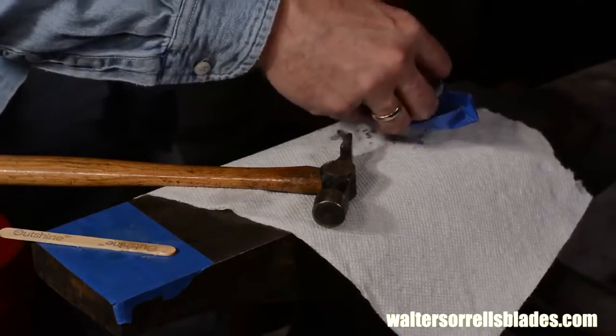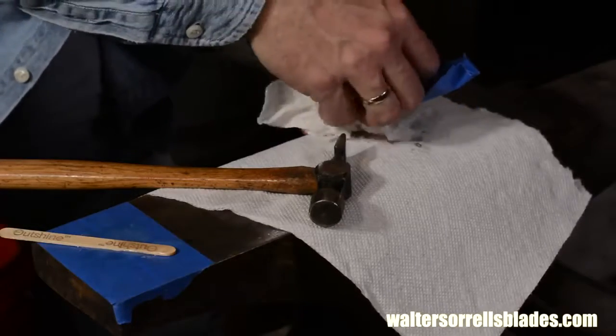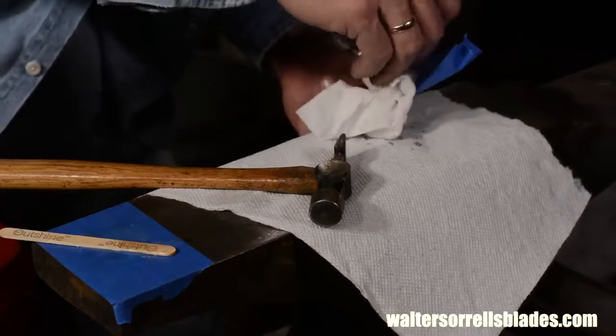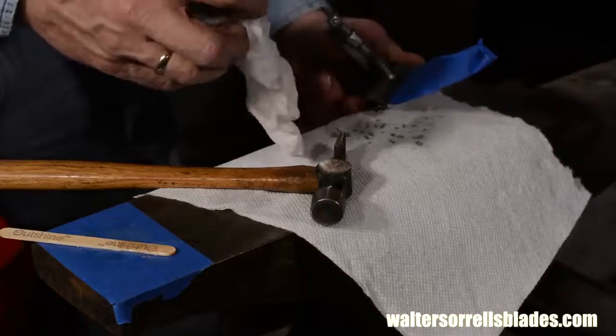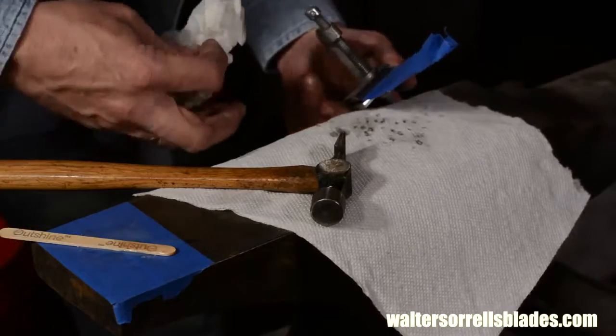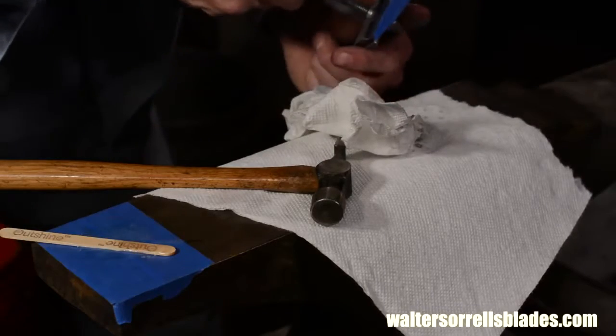If you don't, you'll scratch up your blade trying to remove it later. I'm using lacquer thinner because I'm hoping to grow an excellent crop of cancer in my brain. You may use something smarter. Don't go nuts with it, though. You don't want the solvent getting in the glue joint and leaking all the glue out of the bolster. Just enough to remove the squeeze out, then clean it up and you're done.